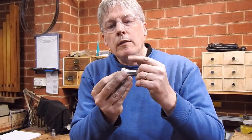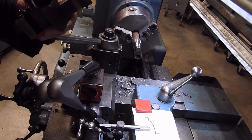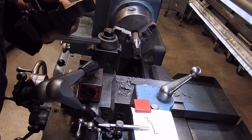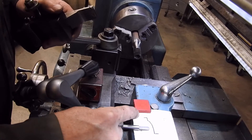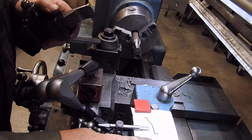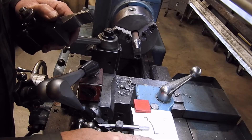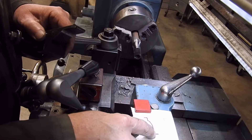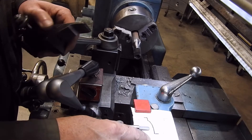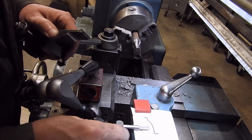And so based on a bit of mucking around on your lathe, you can actually get those sorts of curves. This is after a bit of polishing — but it's certainly possible. This is the setup I'm using for producing the profile. To start with I've got the profile I want, and because my tailstock has got a flat surface on it I use that as a convenient spot to put this. I've darkened that line up with a texta, which makes it a bit wide — there's actually a pencil line in there which I can see, but it wasn't being picked up by the camera.